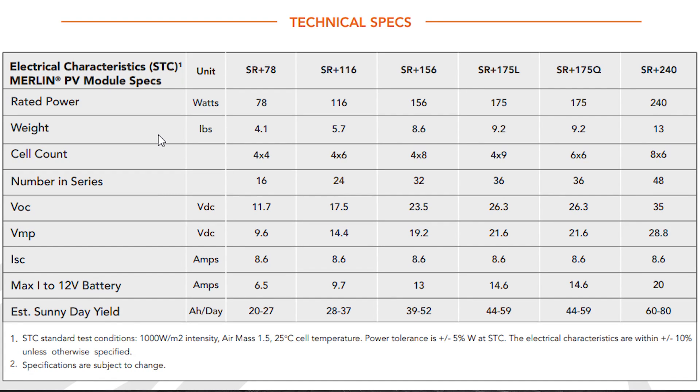You could have amazing output when the solar panels are in direct sun with no shading and everything is perfect — you might see a little bit more than that. But about 5 to 6 amps is what you're realistically going to get, and you're not going to get 10 amps out of a 100-watt panel. So you look at the datasheet from the solar controller manufacturer and make sure the max output of your solar array in wattage and amperage does not exceed the inputs that can come into your solar controller.